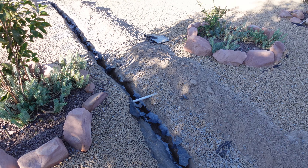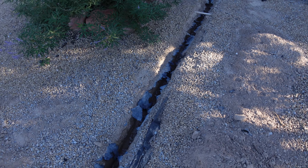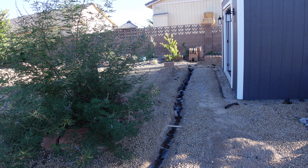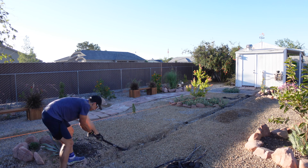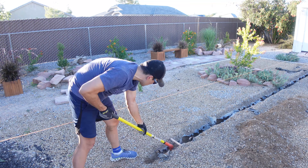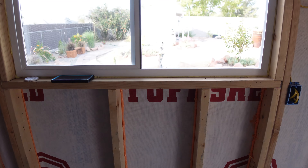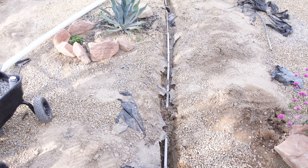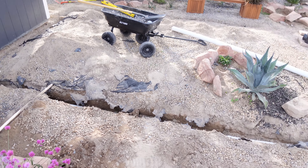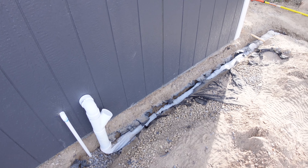Since our last update, you can see we've been busy trenching. Right now we have about 130 feet of our trench for the power line done, but we still have about another 130 feet to trench and we're going to be going through a bunch of root and other things, so that's going to be a big pain in the neck. You can see it curving around the back of the studio right there. In addition to the trench for the power service line, we also had to run a trench for our water. Luckily, our well is over in the shed and that's only about 50 feet from our studio, so cutting that trench wasn't really all that bad. But we still had to use a pickaxe to break the ground up a little bit, and then a trenching shovel to dig it out.